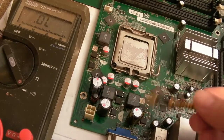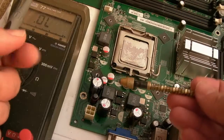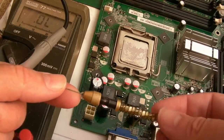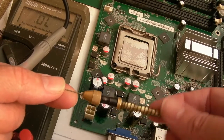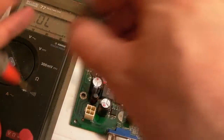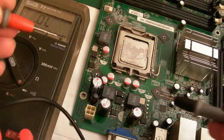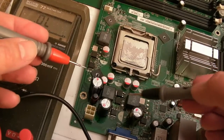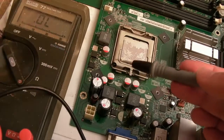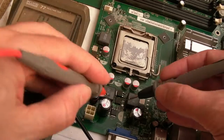If you struggle with these holes, and I was with one of them, get a drill bit and test on one of the holes that is unblocked first. You want a drill bit that's smaller than, or at least equal in size to, the hole, and I just went straight down on the solder. It unblocked really easily. That's just a tip if you've not got the right kit. I've got a good Hakko here, but the tip is tiny, and the solder points are tiny, so nothing's really lost. I haven't damaged the through hole or anything. Let's just measure this transistor now.